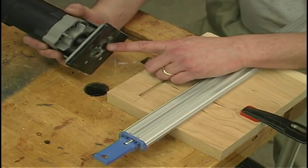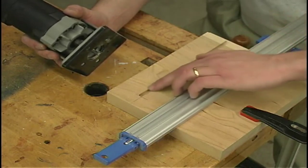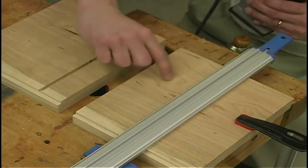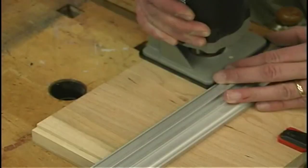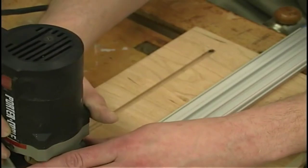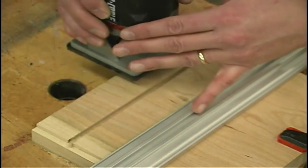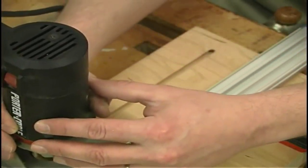To machine that dado I've been using a quarter inch straight router bit in my handheld router, with a straight edge clamp. On the right side you can start off the piece and feed up to a mark as your ending point. On the right-hand piece we'll actually be starting at that point and feeding in the opposite direction. If I were to try and feed from this direction towards me, the router has a tendency to walk away — that's due to the rotational forces while cutting, pulling itself away from the fence. By starting it at this end and feeding away from me, the cutting forces always drive the router up against the fence, so you end up with a nice straight cut.